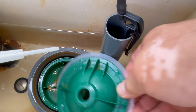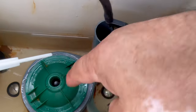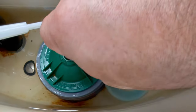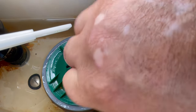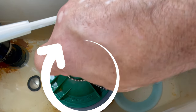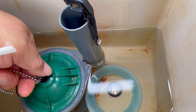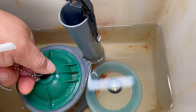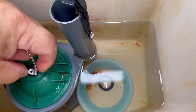Put it right through this plastic screw. You can see it there — the plastic screw is inside and this is the plastic nut. Go inside, center it, then go clockwise and press down as you turn so it grabs the plastic screw. As you start feeling friction, keep going until you hit a click.